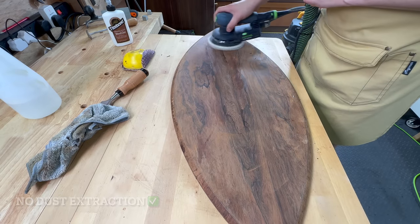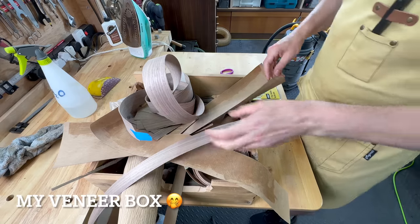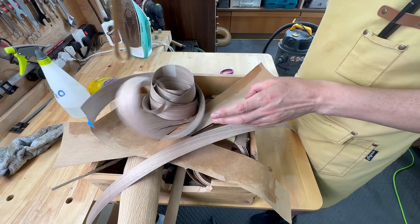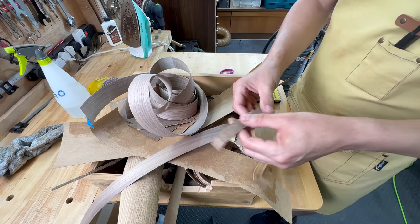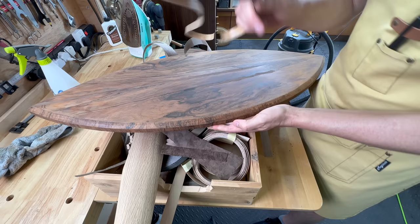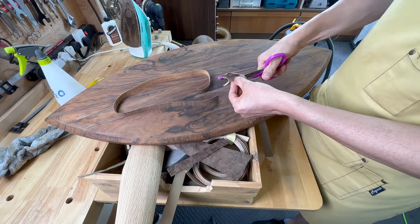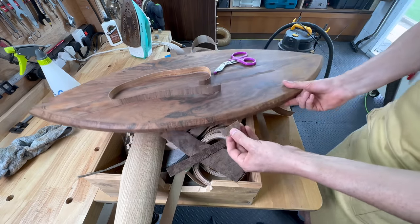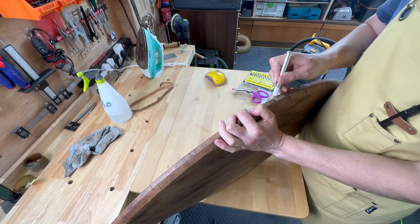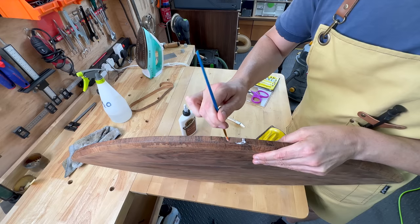I also used transparent wood glue and some sawdust to fill in those little gaps between panels and the veneer. I could have used wood filler but this looks better because the sawdust comes from the wood you're working with, so it's the same color. These are all the pieces of veneer I have left over from previous projects plus some that I buy. I didn't have anything that exactly matched the veneer on this table, but I decided to go with a piece of walnut veneer because it already had some vertical stripes that kind of matched, and I knew with a little bit of help and some tricks I could make it work.